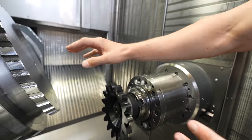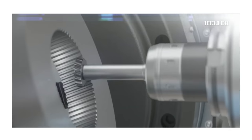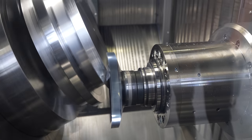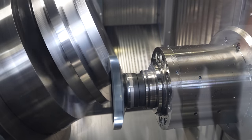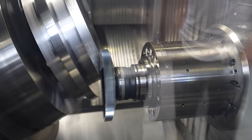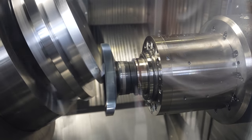Now let's see how the tool works. This giant gear has a rotation, and both rotations are coupled — the spindles are synchronized. With this rotation you get chip formation at the cutting edge in the mesh, moving and pulling out the chip. You can actually see the tool running at a smaller diameter, spinning faster than the workpiece, taking small cuts all the way down. They're not running coolant right now — this is just an example to show the RPMs and how they sync together. You can see it putting perfect teeth in these gears. Power skiving — that's where it's at, it's crazy.